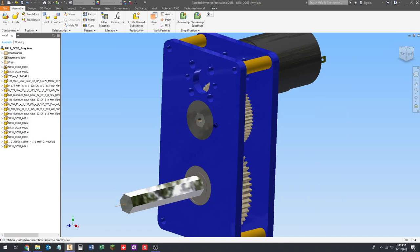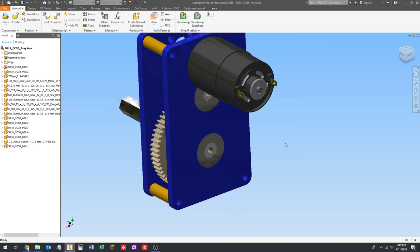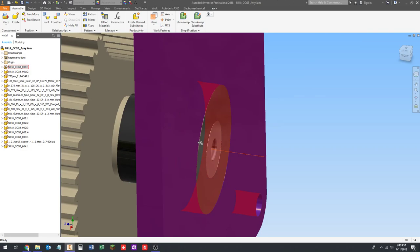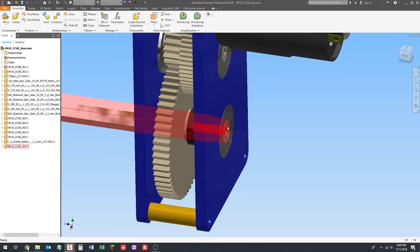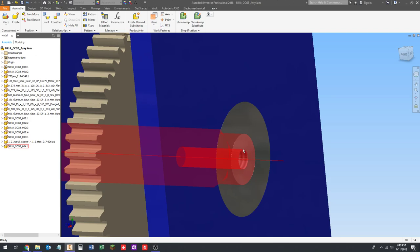Okay, so then down here, these threads can be 3/4 of an inch long. We're going to use a half inch screw here. The only reason is because we have a lot of them laying around. During an actual season, we would try to use fasteners we have. There's plenty of threads there for a half inch long, so we'd use a half inch. Really, you only need a 3/8 length screw or something for this hole, but that's what we have, and there's enough threads for it, so we'll go ahead and do that. So we'll need the half inch long button head. This is a 1/4-20, and then we'll need a washer for a 1/4-inch fastener there as well.